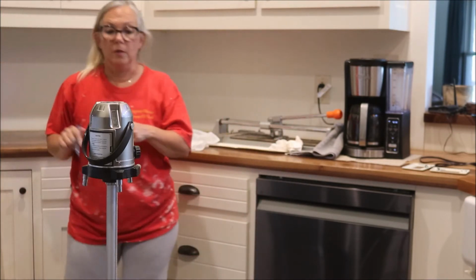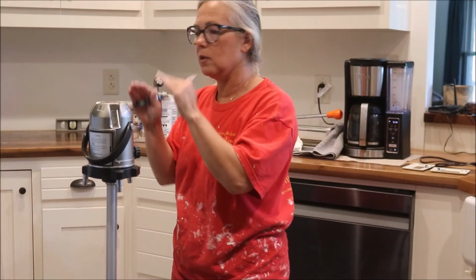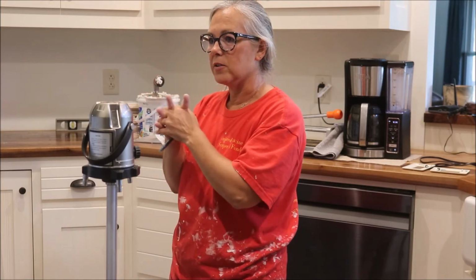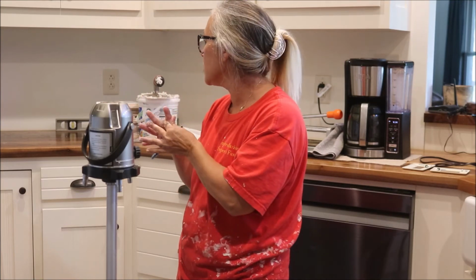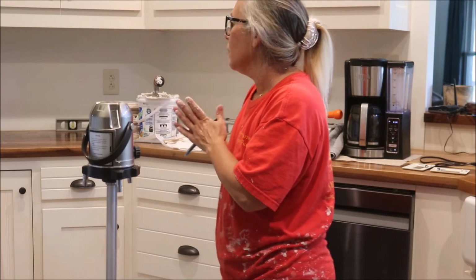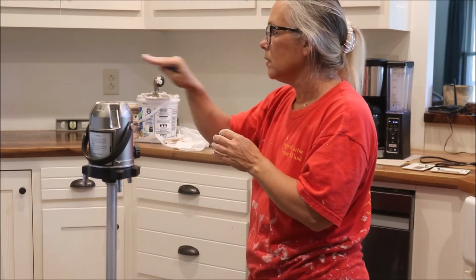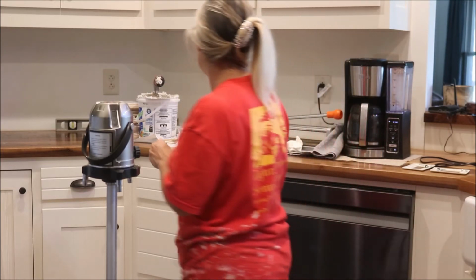All right, the next thing I'm gonna do is the same thing that I did on this wall where I found out that I was a little uneven, even though it's a new build. You know, house settles, wood is wood, and we have these walnut countertops. To see if this counter is level, because if it's not, then I need to adjust my grout lines so that as your eyes go up, everything is even.